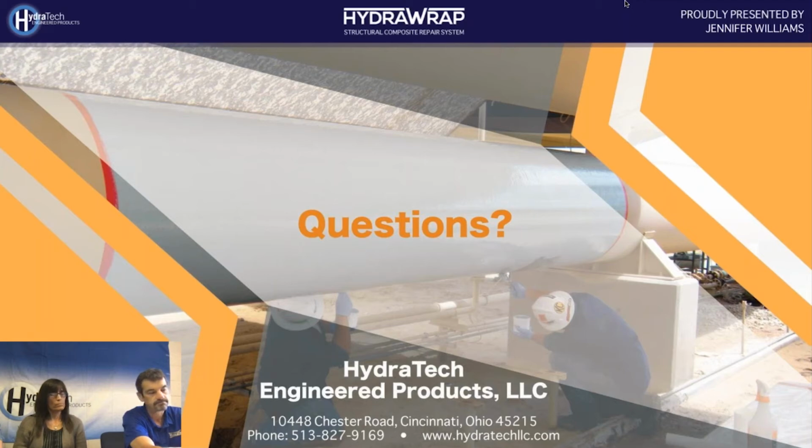Okay, thank you. This is Joe Kindler. I have two questions. One, what kind of preparation do you have to have on whatever it is that you're wrapping? Does it have to be like steel? If it's steel, does it have to be sandblasted? What do you have to do to prepare before wrapping? Yeah, so like any coating, surface prep is critical. And yes, if you're going to look at our tech data sheets, it's going to mention abrasive blasting on steel surfaces.